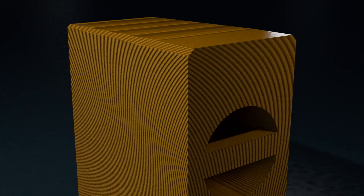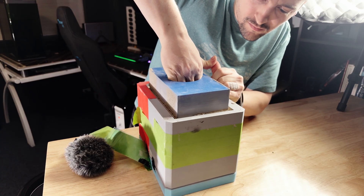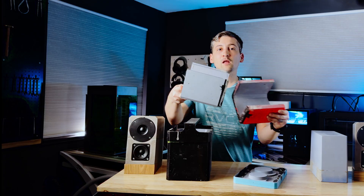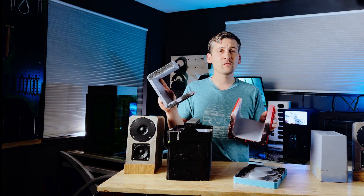I also added a big handle to the inner core so there's something solid to pull on — and that part worked really great. On the outside, I built tongue and groove alignment features so the mold halves would register cleanly. That detail is going to matter a lot later when we attempt to demold these.